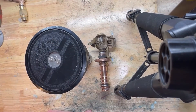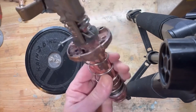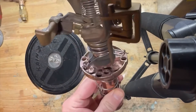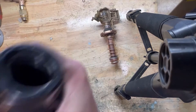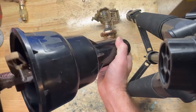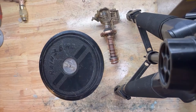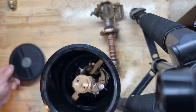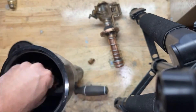Today we're going to take my Rainbird 31 pop-up impact rotor, which is a full circle, and convert it into a Rainbird 27, which is an adjustable part circle sprinkler. You can see here the internal for the 27 — pretty nifty. Frank Norsi at Sprinkler Innovations refurbished this and it just looks great. I got the whole bit, and there's an acorn from when I was running it outside. That's the 31A internal and we're going to take this apart and swap internals.